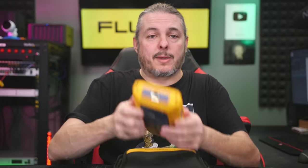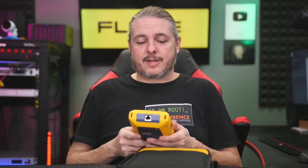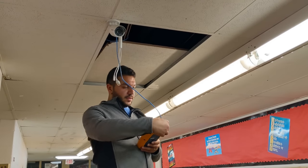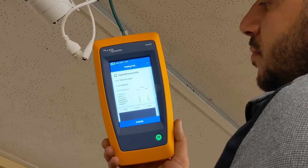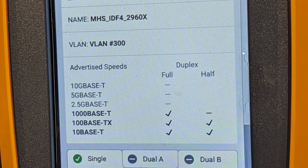I've always found their products to be very reliable and well built. Their network test equipment is well regarded in the industry for low voltage cabling - you can get a reliable result out of the Fluke. This device, being less than a cable certifier but still having some good features, might make it a bit of a time saver. One of the reasons we had it for so long is we spent time out in the field with it. Specifically, we did a lot of testing at a school. One of the really handy things is being able to troubleshoot networks on the active network by providing connected switch information for each switch port number and VLAN ID.